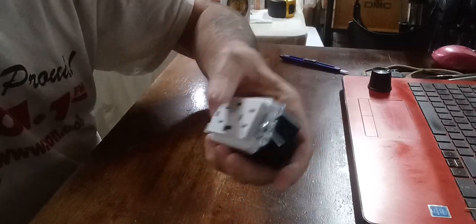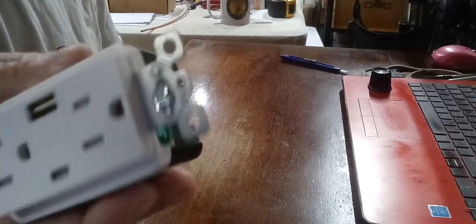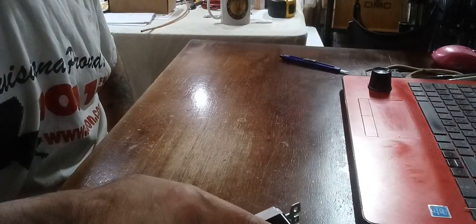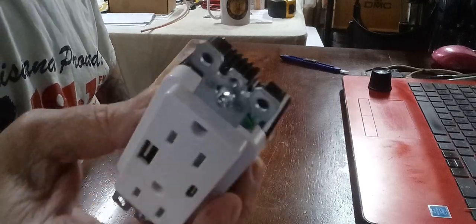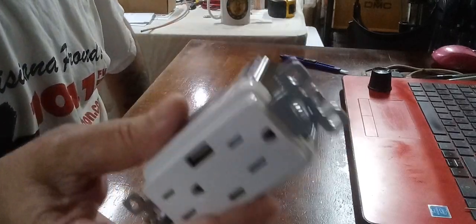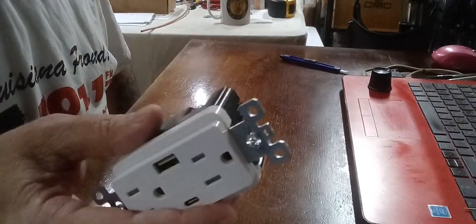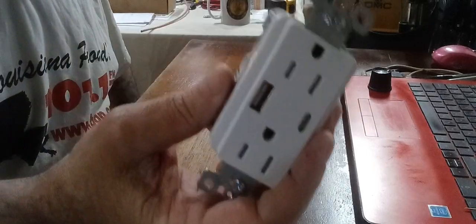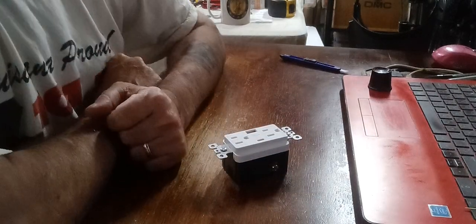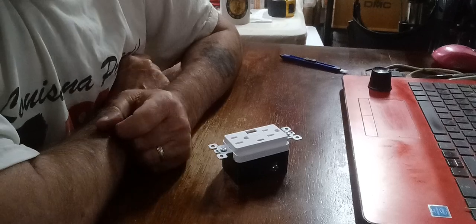It's a kind of smart outlet — you don't have to plug a charger in, so your regular outlets stay free for a toaster or whatever. Now it's not a ground fault circuit interrupter — it doesn't have GFCI built in, so you depend on your breaker. If you have a GFCI on your breaker, that protects it. Ground fault on the breaker is more expensive but it'll keep you from getting electrocuted.